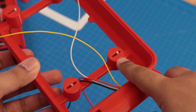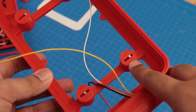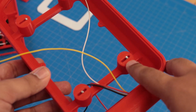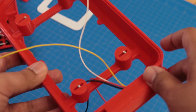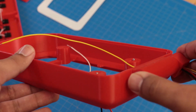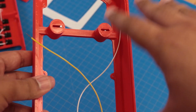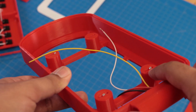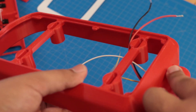You'll notice there are some slots right here too. Originally I downloaded a model of the official Raspberry Pi display and it looked great — it seemed super accurate. I measured some of the big dimensions, but it turned out the model somehow had the screw profiles offset by a couple millimeters. When I printed an earlier version of this it totally didn't line up, and it ruined my day because this is a 12-hour print. So I just went ahead and added slots so I can manually adjust the LCD horizontally so that it looks fine.